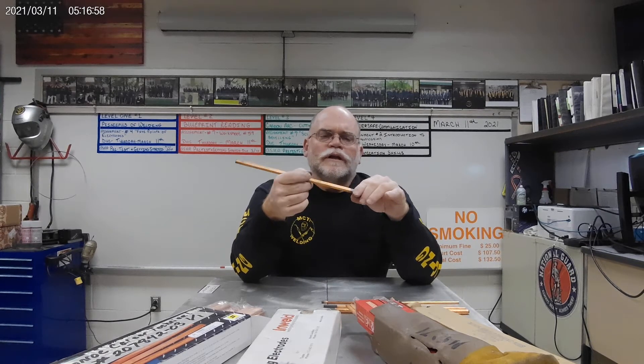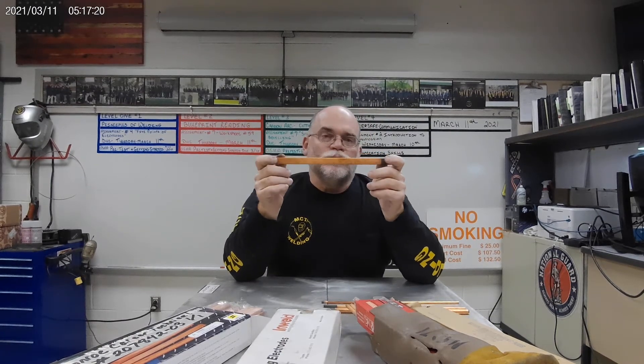This rod is in common use throughout the industry for removing a lot of material fast. Years ago, I personally worked on Trident submarine components and parts. When we had to shape the hull of the escape hatch or escape trunk, we would use rods like this to shape and give it a radius similar to the submarine's radius. Rods like this helped that work move along quickly — there was a lot of shaping that had to be done. That's just one application; there are a lot more, and we'll discuss further details in class.